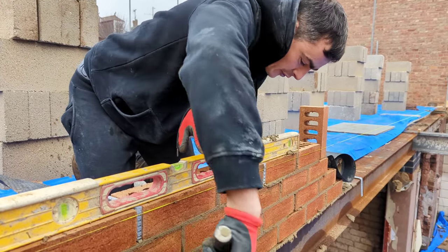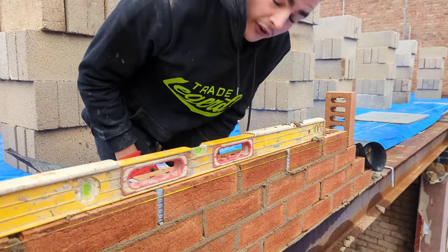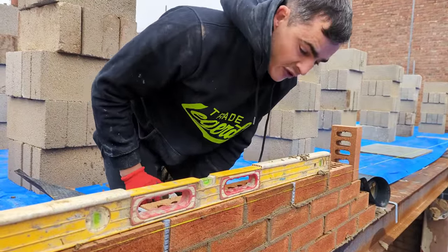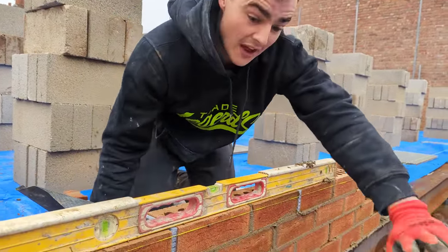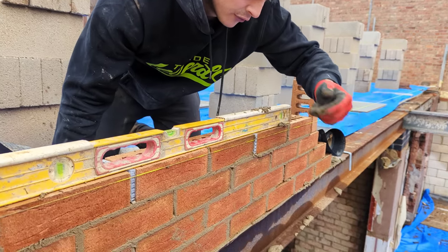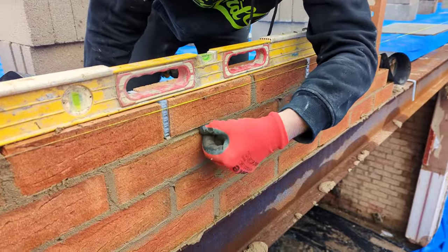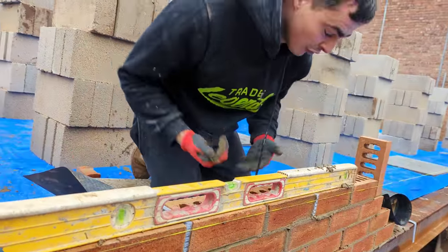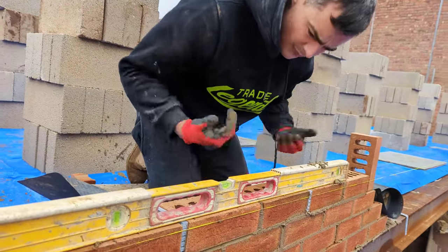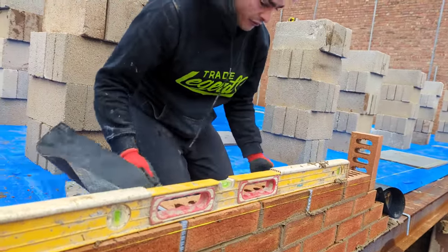One, two, three courses of brickwork aren't actually going to be shown. When we have our flat roof on here, they'll either have a lead detail or some sort of rubber detail, which will be ground out of this joint and then slot in there. So just like a normal lead detail or some sort of waterproof detail — that's why we've put the tray in there.